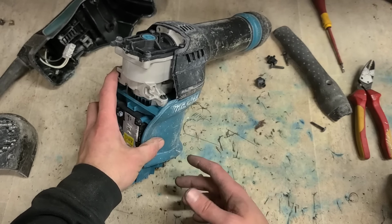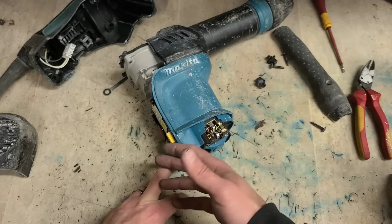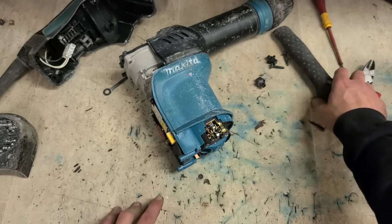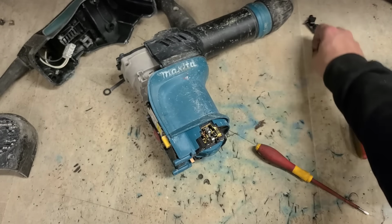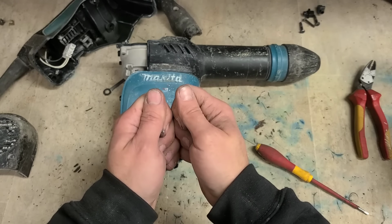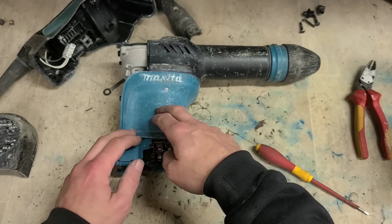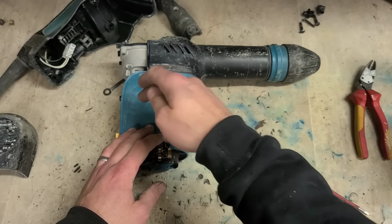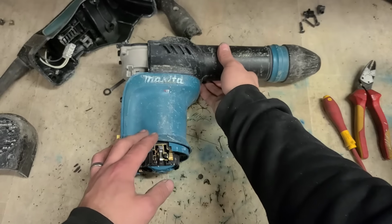The only other thing it could be is the field. Now, I'm guessing more than likely it was his transformer or an extension lead he was using. But now it's on here, we have to check. There's a broken field that can sometimes run and then not run. The connection's broken. When she gets hot, she can expand, break the connection, it stops running. It'll not run again until the machine cools down. When it gets nice and cool, she contracts again, makes the connection, and she runs. She'll run again until she heats up, then it breaks again. Very odd time that can happen.